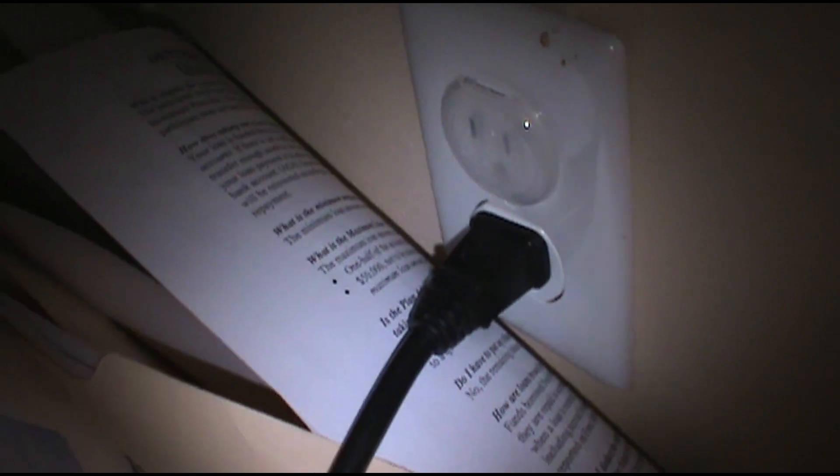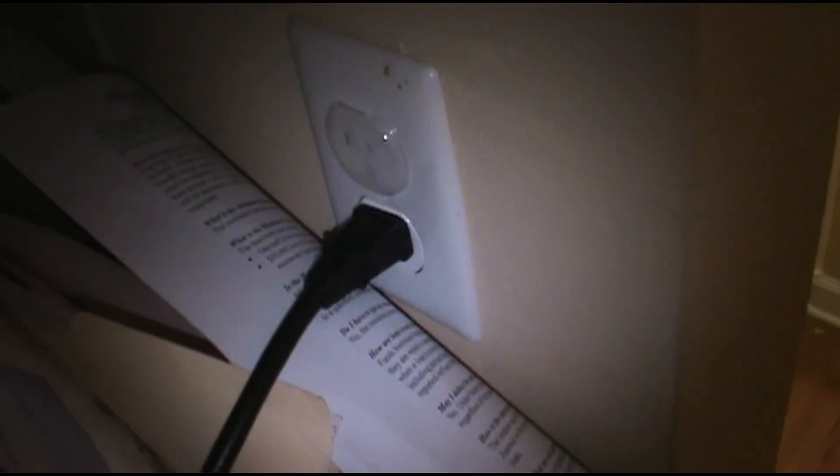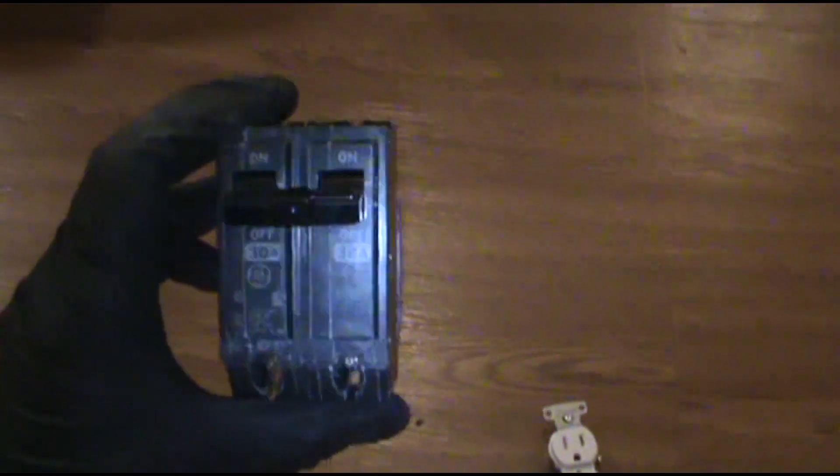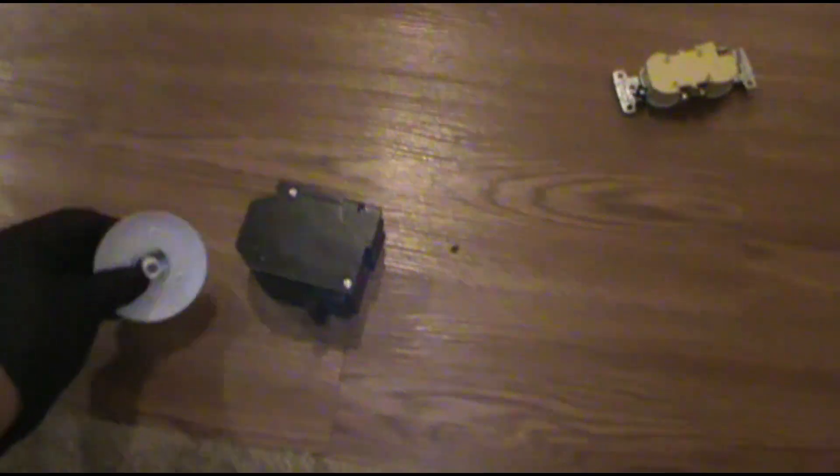I'm going to turn the power back on and check all the outlets in the living room because none of them were working — only one was. This is the last outlet in the line; it wasn't working earlier. Good to go now. That was our problem — it started behind that couch. What a party: dryer not turning on because of a cracked knob, dryer not heating because of a bad breaker that was sizzling, smoking, and giving intermittent 240 volts — really weird. Living room outlet melting. What a party — and I'm by myself today starting my own call week. Thanks for watching The Dirty Maintenance Show.